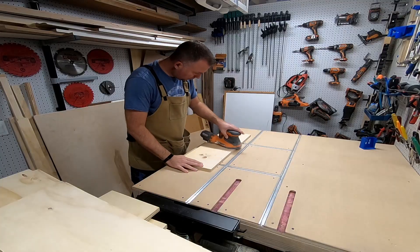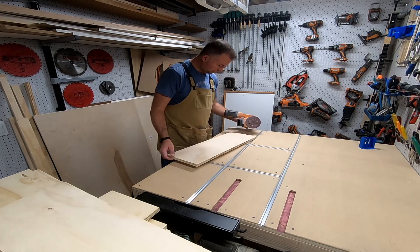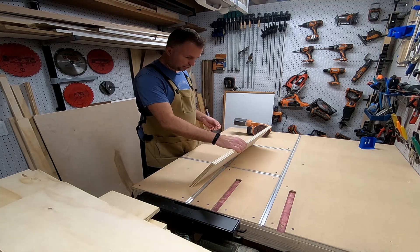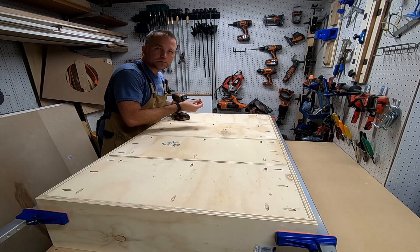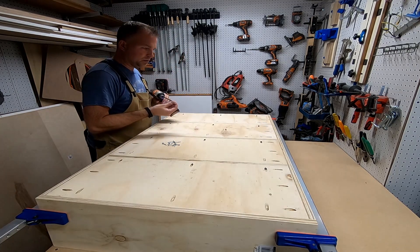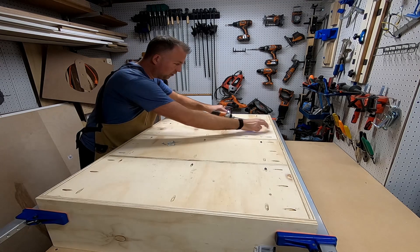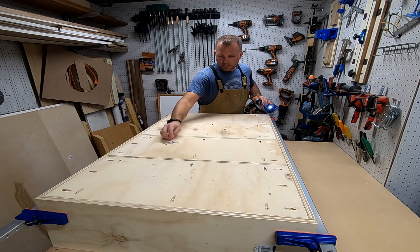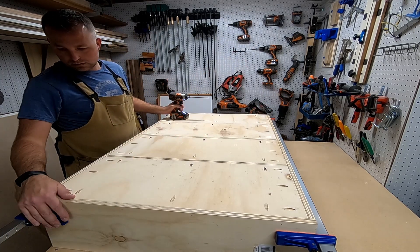Give everything a quick sanding on the faces. I've got all the pieces set up and pocket screws done, so now we'll get it all put together and get some primer on. I'm just finishing the last few screws here — you can tell I've got all kinds of screws in the top to support this thing. It might be a little overkill but I want it nice and sturdy since it's fairly heavy. I've got it all clamped down — you can see how I've got all the shelves in here.